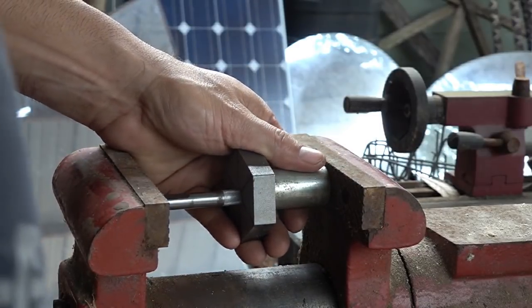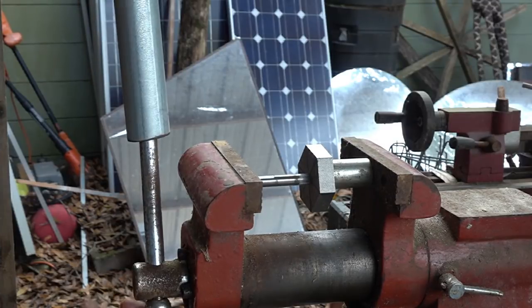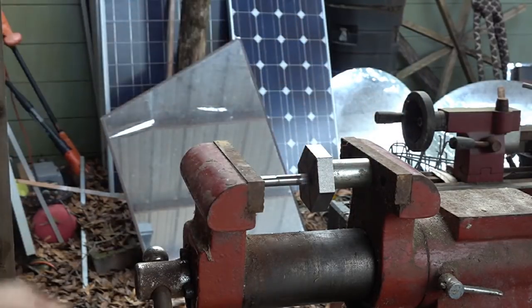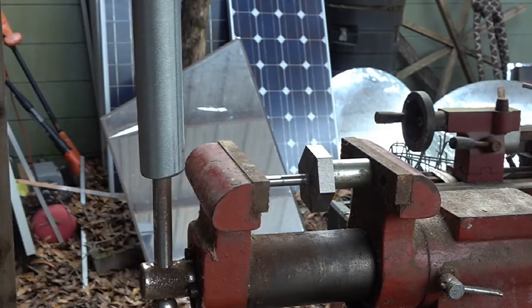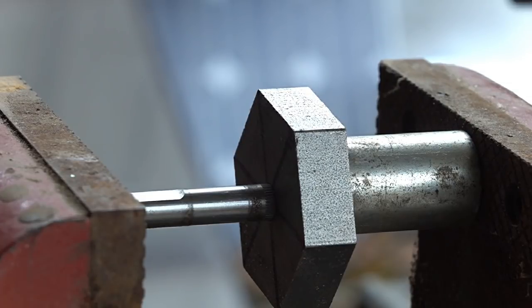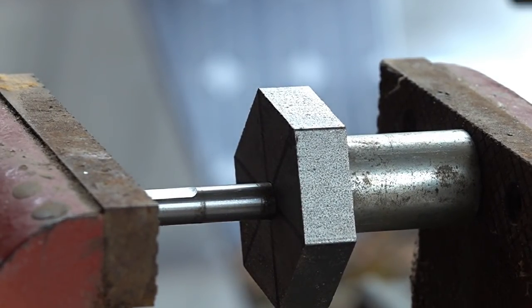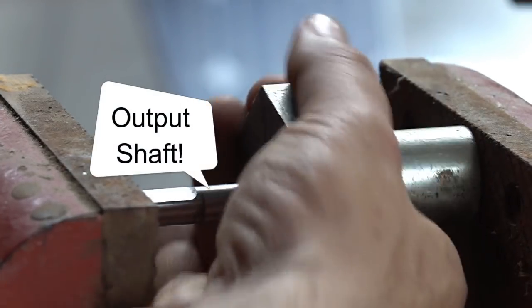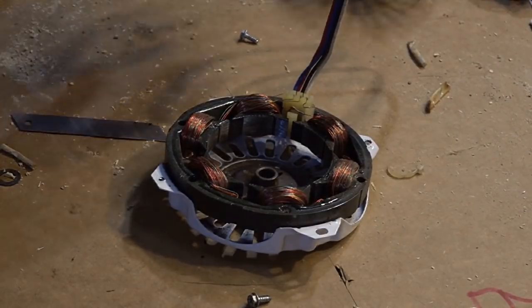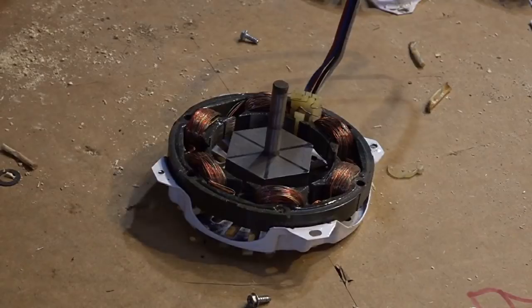Put it in there and tighten it down. You may need a piece of steel pipe to give you more leverage. If you have a good $30 vise, this works. We're going to pull this down across the threaded part — instead of putting it on this side to push it off, we're using it over here to push it on. When you push this, you'll notice it closes the gap and you want it to cover all the threads. Done — ta-da! Because this came from there, it's locked in. No need to add screws or anything. It spins nicely.